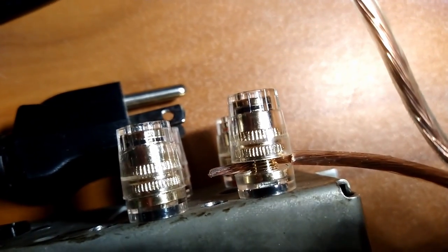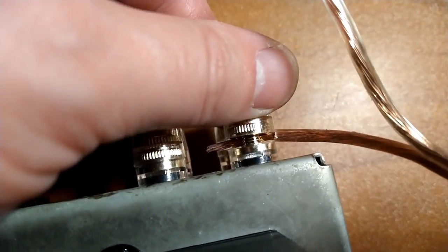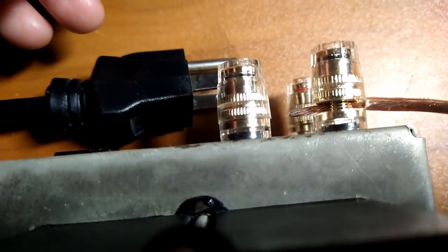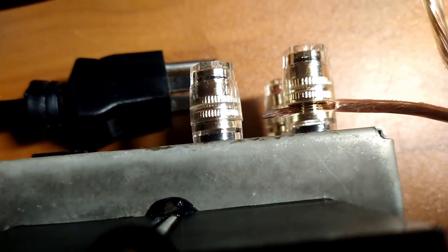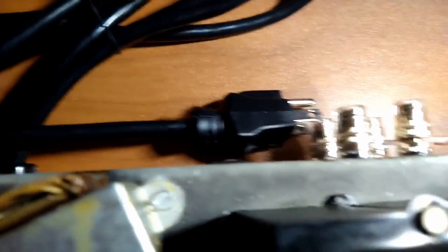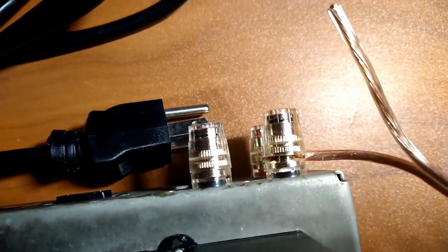Anyway, as discussed, we want to stick the bare wire through the side of the binding post. And when we screw it down, we don't want to screw onto the insulation, just the wire itself. Over here, you can see on the tinned end, we got about, I don't know, 3/16 extra sticking out, so we're going to go ahead and trim that. We can do that right here, because this is in the perfect spot. We'll go ahead and get our flush cutters. See if I can do this one-handed, backwards through a viewfinder. Boing. There you go. Perfect.